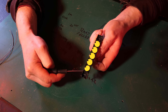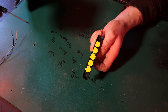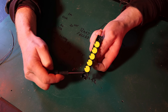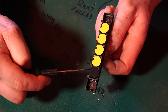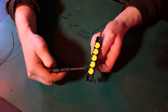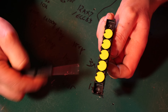There are a couple of advantages that Flip Dot Displays have over illuminated displays. Number one, it's more visible in the daylight — imagine if you've got bright sun shining at it. You can have a better time distinguishing between the bright yellow front and the absolutely pitch black background over an LED display or something like that. Also, the other advantage is they don't need constant power to show an image because they have magnetic memory. When you flip the poles inside, they'll stay flipped until you flip them back.